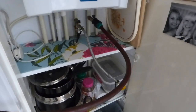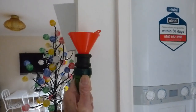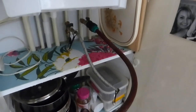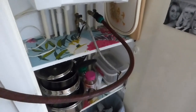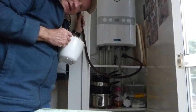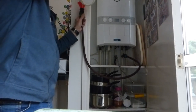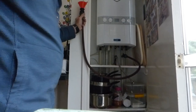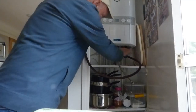These little rubbers will fit nicely over the end of the little valve. Here we have our arrangement then: with the valve open, put a pipe on it going around to a funnel at the end - keep it higher than the fitting and it will pour in nice and easily. If you're unsure about any leaks where the pipe goes on, you can do a jubilee clip arrangement. Now your inhibitor goes in here - just tip it straight into the funnel and let it drop into the system. Very simple, easy way of doing it. Once it's in, shut the valve back off.